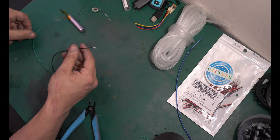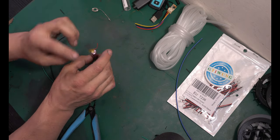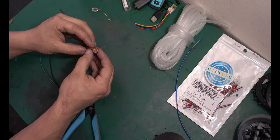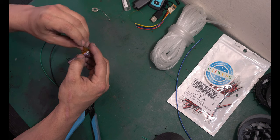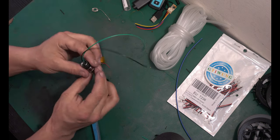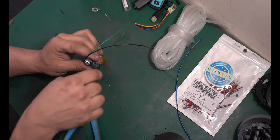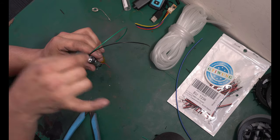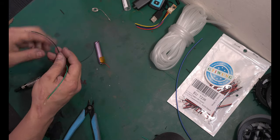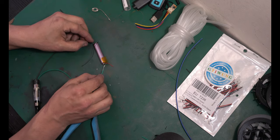Now, with that done, you should be able to take the positive and negative and just lightly touch them to the ends of the battery or whatever battery pack you have. Now, if the wire starts to turn bright red very quickly, you have a little short in there somewhere. You need to make sure that the green wire, the middle center wire, is only touching that little center pin and it's not touching the case. So be very careful. I don't suggest touching it with your fingers,